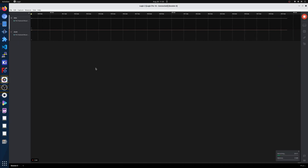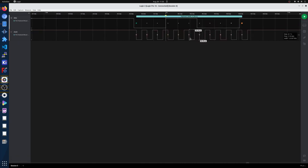If I press the key A, we'll see the start bit here in green, our data bits, the parity bit, and this would be the stop bit high.